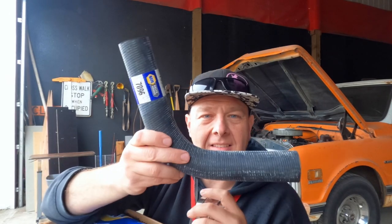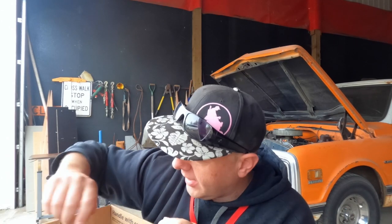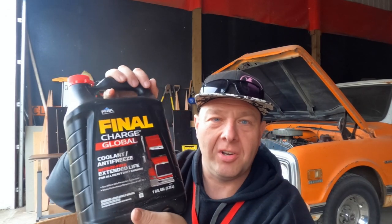I measured the size of the pipe and guesstimated the length. It's one and a half inch diameter - that's just feeding the heating system. I've got some hose clamps. The only thing I don't know is how much coolant we're going to lose in the process. Looking through the service manual, it says I can close some valves and it should isolate it mostly, but one of the coolant line comes directly from the engine, and the radiator is about six feet in the air. The system holds 21 gallons, so I'm banking on catching some of it with this bucket and not losing more than six gallons.